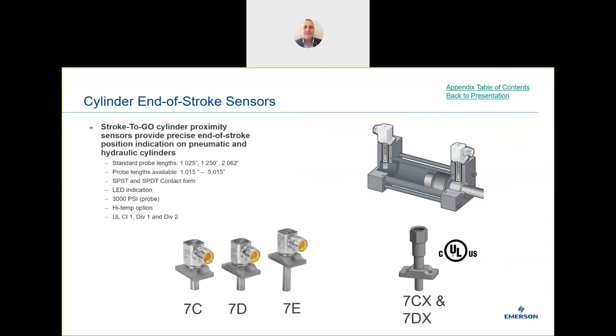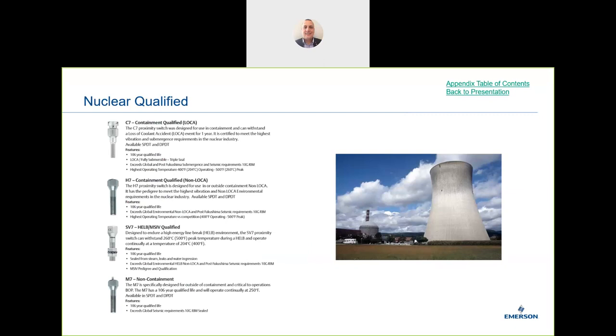For cylinder applications, we've had success with the Aventics range — specifically the NFPA cylinders which are solid and dense. This device provides end-of-stroke sensing. Another key application is hydraulic rams on die casting equipment, where high internal pressures and heat are present. Because our device is not affected by heat, it is an ideal solution for die casting applications.